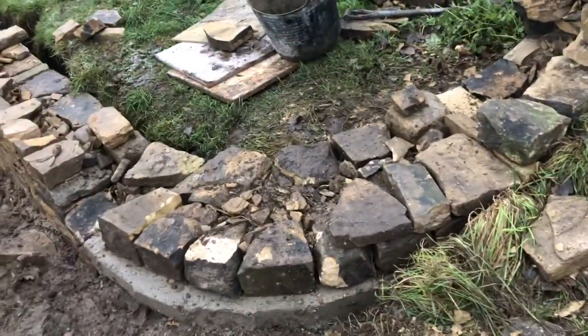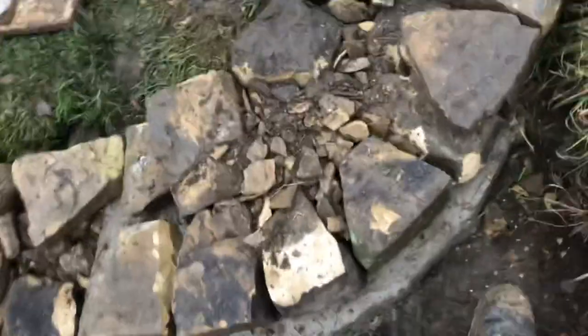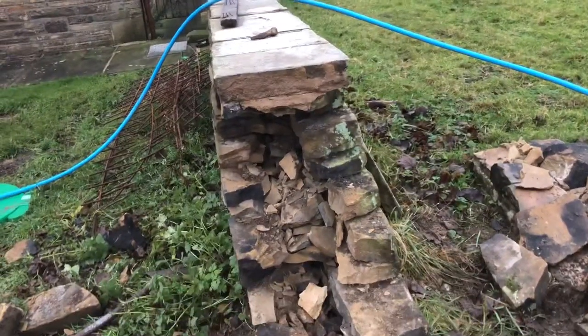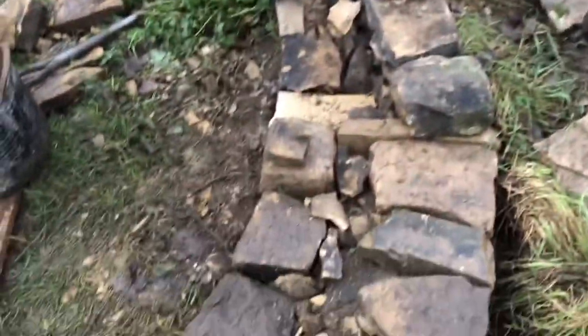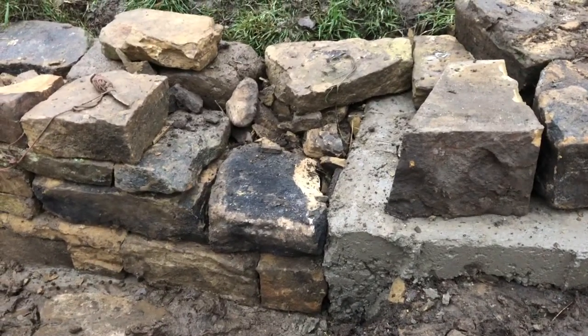Okay, so you can see the footings are put in just traditionally, just on top of the concrete. So still fill it, everything's exactly the same. Obviously I'm going to tie into this, it's not very good, but the customer does not want this section rebuilding. So I'm just going to have to deal with that. I'm still going to build my wall straight, and then if that comes down in the future, we can deal with that. I've just left this bit so you can see where my wall yesterday is going to tie into the pad. I'm going to try and bridge that like you would normally.